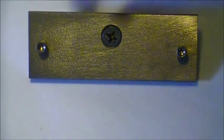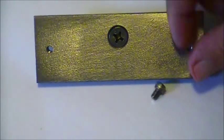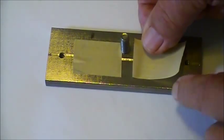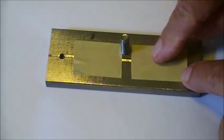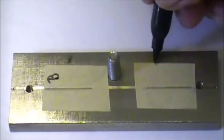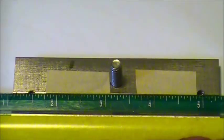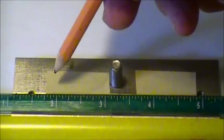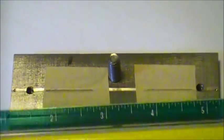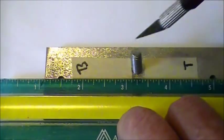To start the cutting block setup, we begin by removing the anchor pins. Apply two pieces of tape about an inch and a half long, one on each side of the anchor bolt. Identify each end of the soundpost: B for bottom or back, and T for top or belly side. Using the mounting groove as reference, draw a fine center line on each tape. Alternatively, cut the center line with a sharp knife for accuracy.